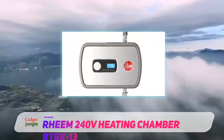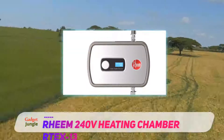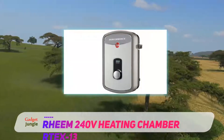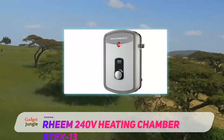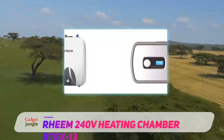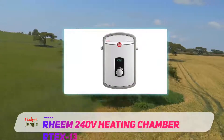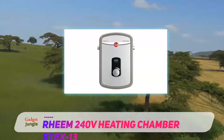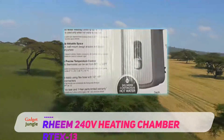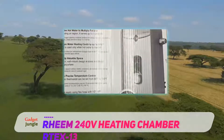If you live in a very cold area and are planning to use this for more than one low-flow shower at once, this might not be the best choice for you. In terms of overall functionality, this unit has a relatively low output rate. You'll probably have to limit yourself to one shower at a time if you don't have low-flow fixtures installed in your bathrooms. This Rheem is a great choice for smaller households without a tremendous demand for hot water, or for bigger households willing to do one hot water task at a time. This one is not the best choice for the cold northern climates, though, and it's not for medium-larger households who don't like to think about managing hot water usage.